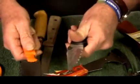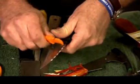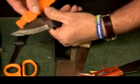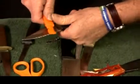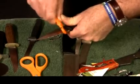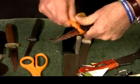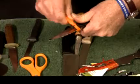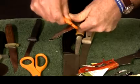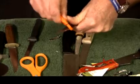I always start by making a pivot out of my thumbs. I'm right-handed, so right hand under the right thumb under the left thumb, 90 degrees to the blade this way, not parallel, not 45, 90. Make a pivot like this and do this. You don't dig at it hard, touch it light, and just slide it through the contour of the factory grind. Then just come down here and do the next one. Go right on down, do all 5 of those round holes, just like this.